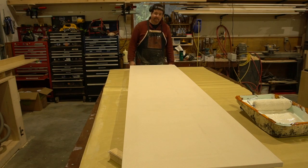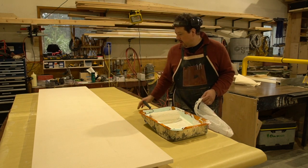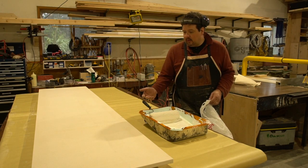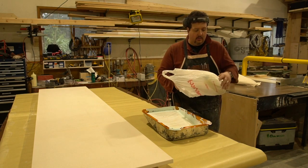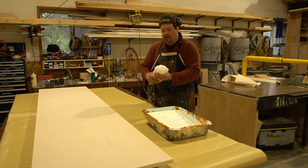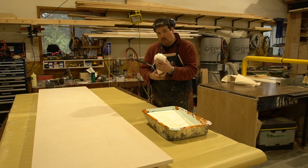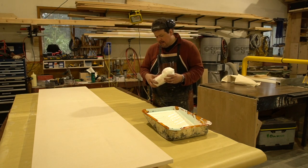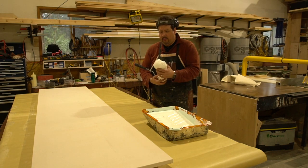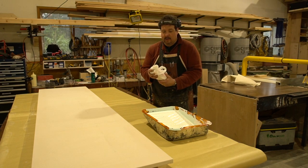I'm not going to use this right away — I built this out of order just for when Sherwood was available. I still have to build all the other frames, but I don't want to go to the trouble of washing this in between. What I do is grab a plastic shopping bag — that will keep the oxygen out of it. This is heavy; it's full of water and glue. It'll keep the oxygen out so it acts just like a glue bottle and the glue won't harden. Some people freeze this stuff, but I've found that if I forget them in the freezer they dehydrate over time and it just trashes it anyway.